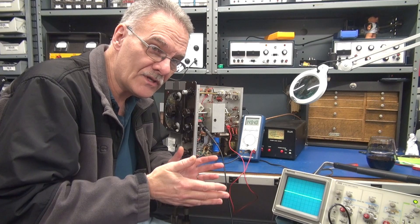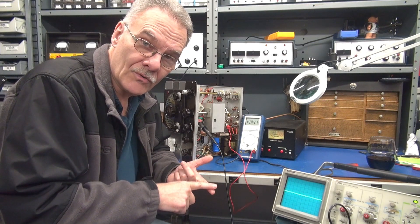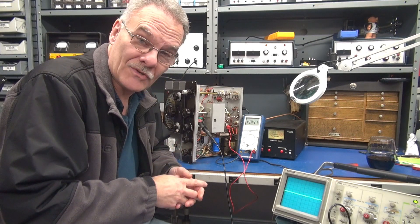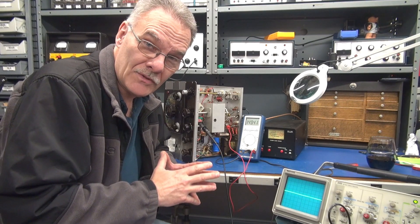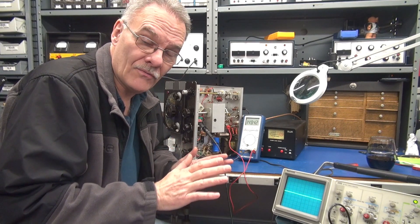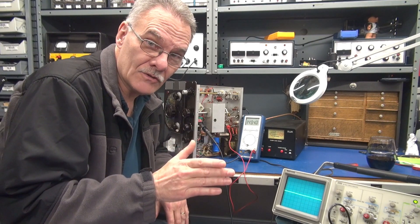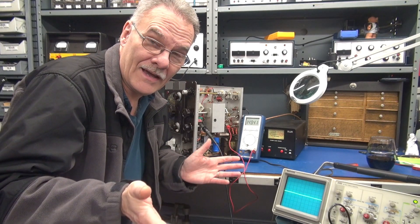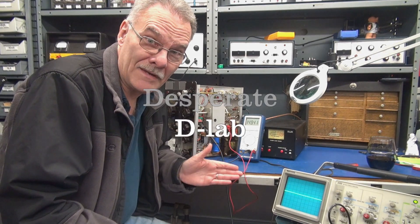The negative voltage is approximately negative 50 to negative 60 volts on transmit; the manual shows negative 80 — I don't really know if that's the issue. High voltage is good. Going to the 6146, I've checked all the tubes and gone through the schematic over and over, verified everything is correct. So why won't the stupid thing transmit? I need to put it on the shelf and move on unless somebody out there can say, 'Hey Terry, I've seen this before — check this.' Can any of you guys help me fix the Navigator? It drives me nuts.